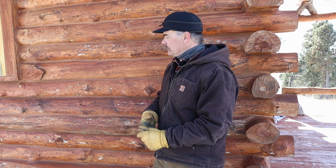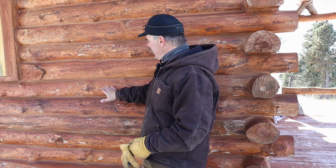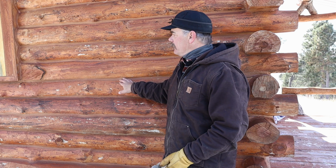Another question I got a lot from viewers is, what do we use for chinking? The chinking product that we used is a commercial chinking product that you can get online. The particular brand we used, I think, was PermaChink. The chinking process was not too difficult. There's a little bit of a learning curve with it. There's a few specialty chinking tools that you need. They're just little specially shaped spatulas. The chinking product just comes in a 5-gallon bucket, and depending on the gap between the logs, you may have to back the gap with backer rod.